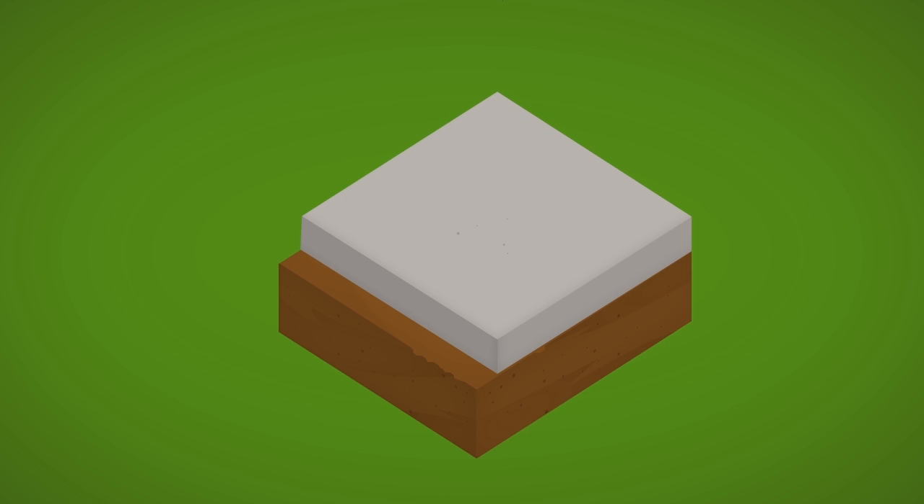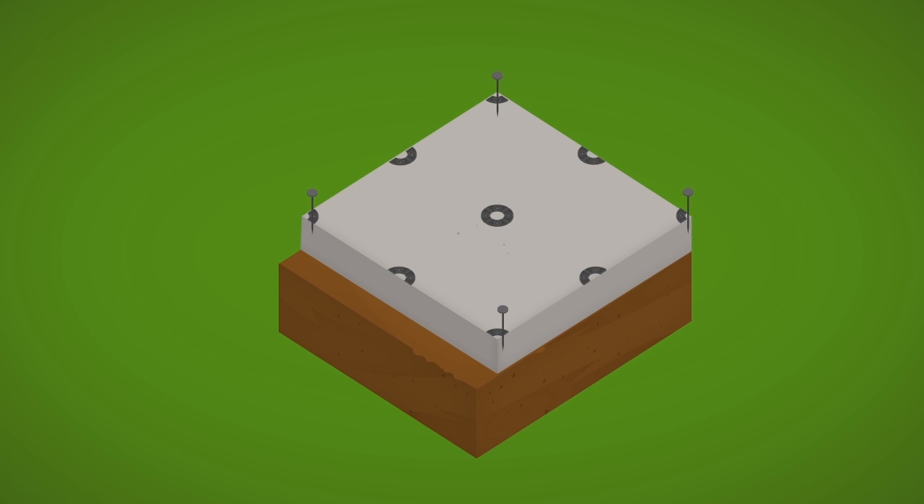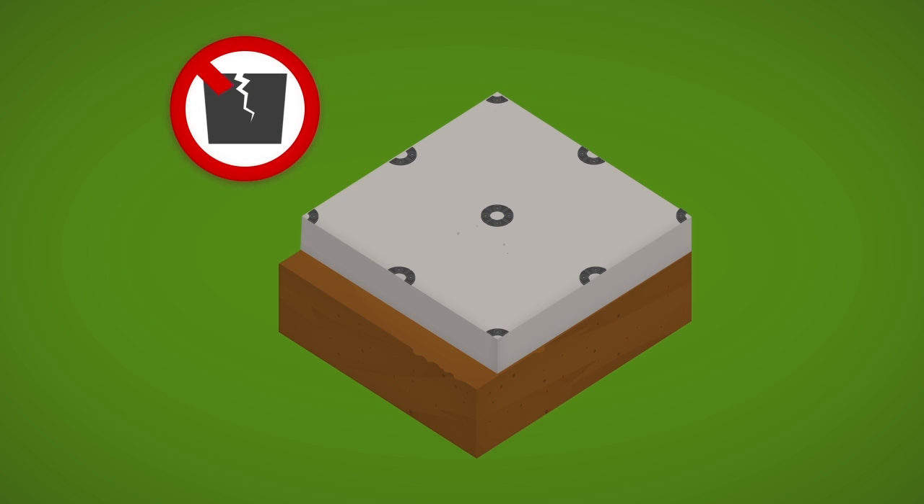The plastic 20 millimeter, 3/4 inch pedestals must be anchored or adhesively bonded to the concrete base for raised installation. Pedestals must have a rubber covering on top in order to prevent any slab breakage.